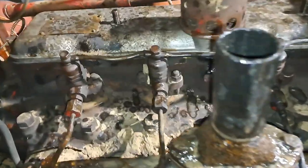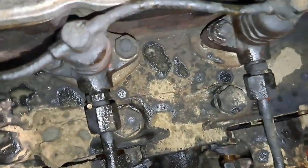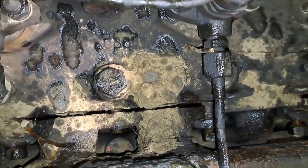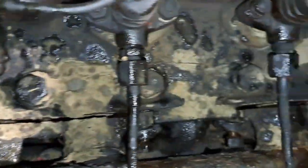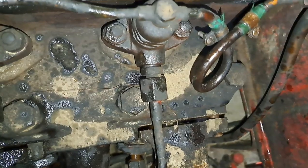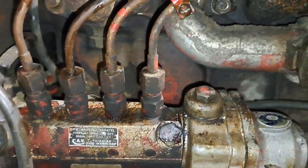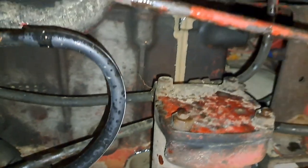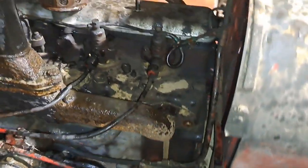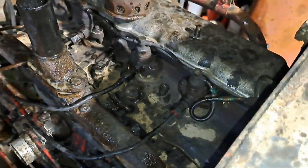So yeah, that was definitely hydraulicking then, which is not good. But you can see in the gap there, I've just released this manifold off. Just draining all of that rubbish out. Look at all them dribbling out. That's probably some silt and a bit of oil and whatever I chucked down there. So that's what was blocking the cylinders up and then staying in the manifold.